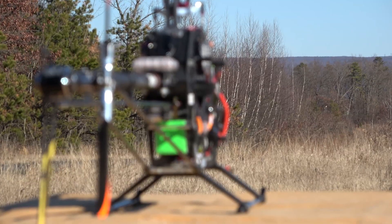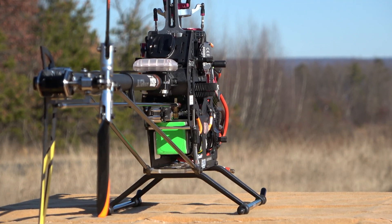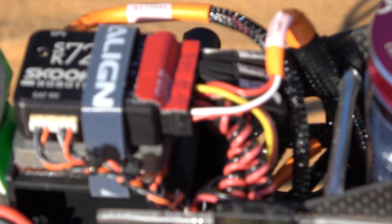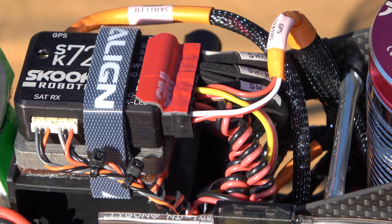I conducted pre-flight vibration testing before the maiden flight. The avionics unit I have on board allows me to do vibration logging. Depending on the frequency and amplitude in the log, you can detect if there's a problem in the tail, the motor, or the main rotor assembly and address any issues. Every fastener on the airframe is loctited in place — some red, but mostly blue.